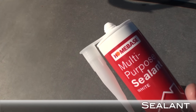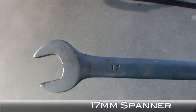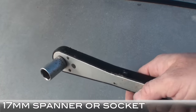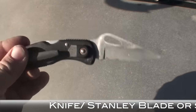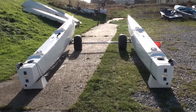You're going to need a few things: some sealant to stop the boat leaking, a 17mm spanner and a 17mm socket — or another spanner will do, though the socket's better. Some grips — here we've got TurboLuck, the finest grips a man can get. And finally a handy knife or something similar, basically for removing the old sealant.